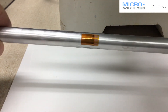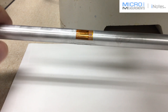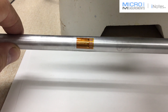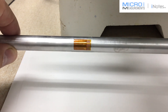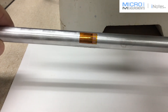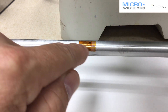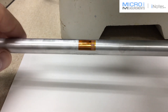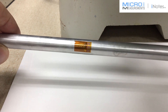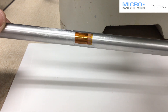This is a dual element strain gauge. If you look at it closely you'll see there are two grids, one perpendicular to the other, both oriented at a plus or minus 45 degree direction from the long axis of the gauge. Additionally, these strain gauges have one common connection in between the two grids, so essentially you would build at least a half bridge — and in this case we're going to build a full bridge using these two strain gauges.